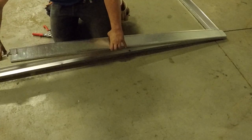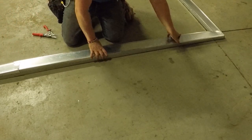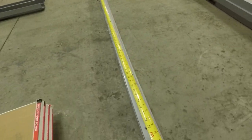So fishtail on one end and a corner on the other — I cut a little extra. For a three and five-eighths wall with five-eighths drywall, I'm going to cut it at four and a big quarter. That four and a quarter — even four and a half inch — is perfect. You just want to make sure the drywall can slip in and nobody has to modify or cut the steel. When we get the steel up top, we'll put screws in there so it's all square and mint.